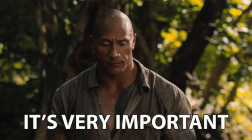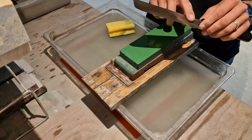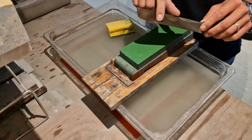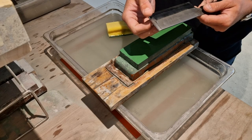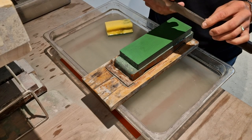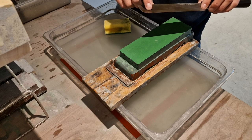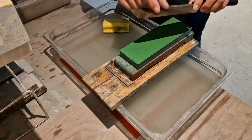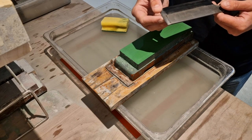The stone is flat and the knife is straight — very important with single bevel knives, because you want to sharpen the backside later. If it's not straight, there will be certain areas which you won't touch. You use the backside sharpening only for burr removal. You make a burr on the koba with every stone you go through, and then only on your last stone — preferably something higher than 6000 grit — you touch the backside. That's just burr removal.